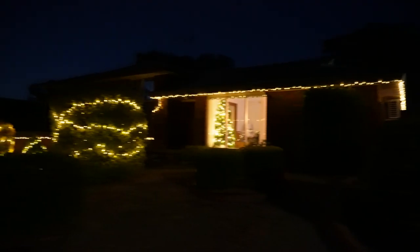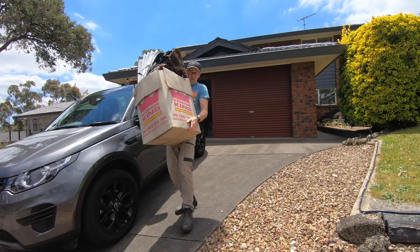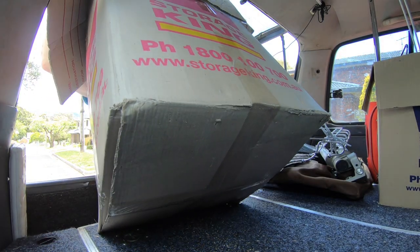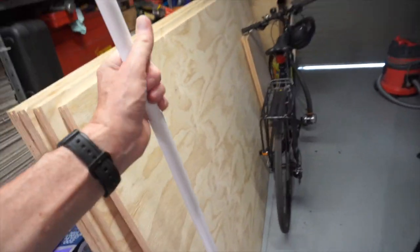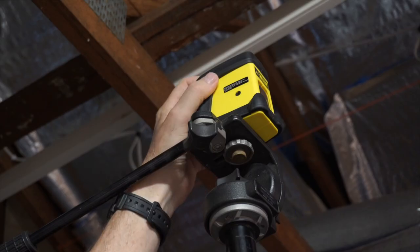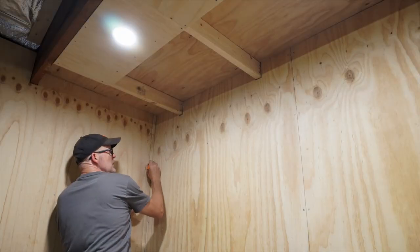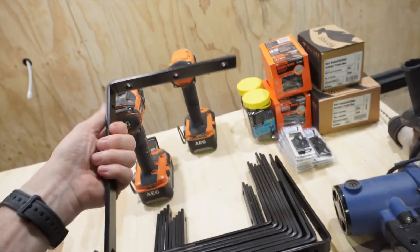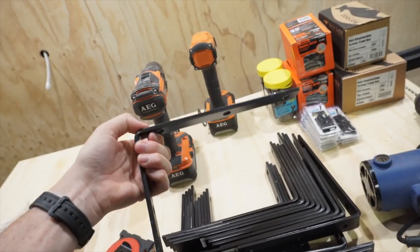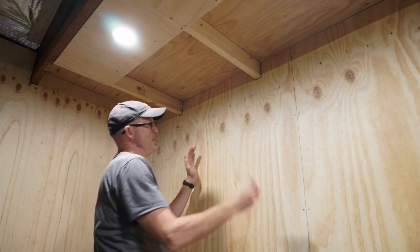I know it's embarrassing by comparison, but we've got to start somewhere. I've made myself a little bit of working space here — all the stuff from previous videos I've cleared out, stuck it on the car, it's all donation stuff I've got to drop off at the Salvos. These are the timber sheets for the bench top and shelves — 25mil thick ply, nice and heavy. The first step is to crank up the laser level, get a level line on the wall, and then go along and mark with a pencil everywhere a bracket is going to go. These are the heavy duty steel shelf brackets — the slightly lighter ones are going to be for the bookshelf along the top. The brackets will get bolted into where the battens are behind the sheets, and I know where they are because that's where the screws are.